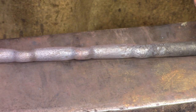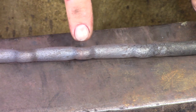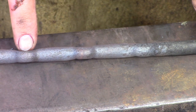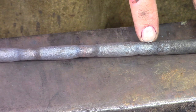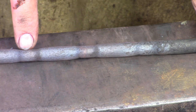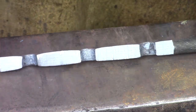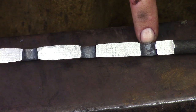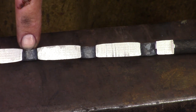These are the three holes you just saw me punch and drift. The first was the upset, punch and drift. Next was punch and immediately drift on the half round bottom swage. Then lastly, punch and immediately drift on the flat face of the anvil. This first one is by far the most robust. This is intermediate, and this is the thinnest — it has a slight flat spot on the top from being against the anvil. Looking on the inside, again this one is most robust: upset, then the half round bottom swage, then the anvil.